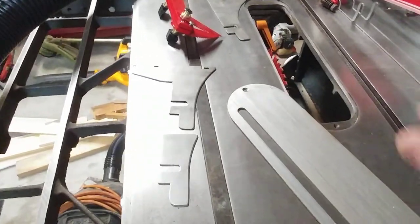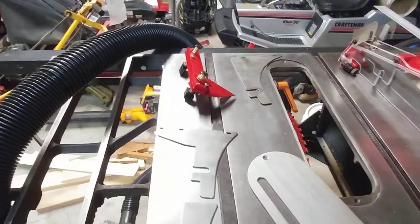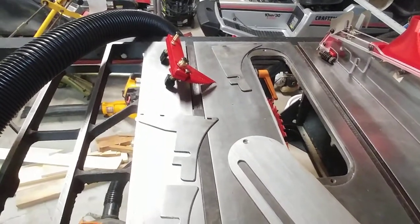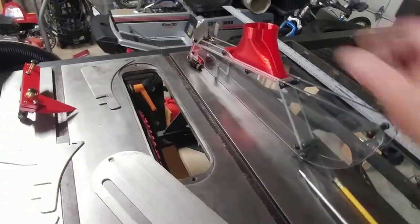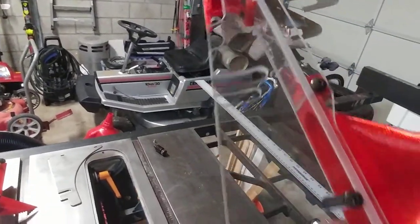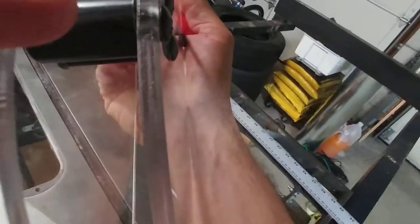The product itself is really amazing, good value, and adds so much safety. A splitter to keep the wood apart in the rear, anti-kickback claws if you're cutting a lot of dimensional lumber like two-by-fours where a little surface scratch doesn't matter, and the guard is done really well. All the parts fit very well — the screws, nuts, and spacers. In the front there's a spacer that actually swivels so it rolls over your wood surface.